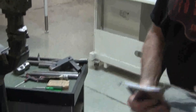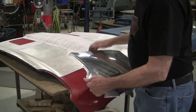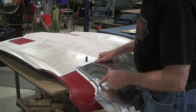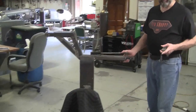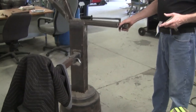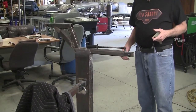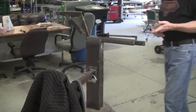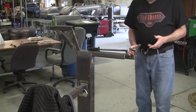Now we'll hit it with a hammer and get that plane flattened. You can see I've got that nice little flip-up over here, just like it is over there. I've got to get this all seated properly. Depending on how much I shrink or stretch that, it'll change this curve here. Right now it looks a little too tight, so we're going to hit that down. This is my post dolly setup — these are just truck brake drums. You can get them almost for free or a couple of bucks; they throw those out by the millions every year because they're out of spec and they make awesome bases. This is just a piece of angle iron that's been boxed — tubing, two by two, quarter inch walls — with a little offset and a little wing on this one for a lower position. These are post dollies, just mild steel, with a one-inch stem on them. I make these ends that you can lock for both the height and the turning — they're on the Pro Shaper website for sale.